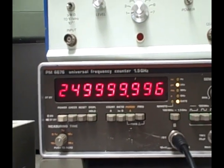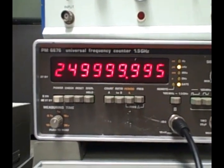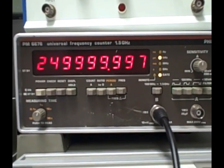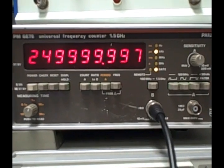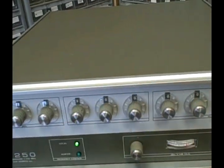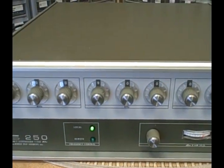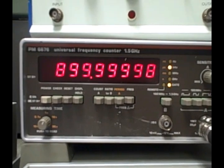Dialing up to 250 MHz, the high end, we had to set 249 and all nines to get there: 249,999,997 Hz — so within three hertz of 250 MHz. I then dialed to 900,000 Hz, technically below the specs, so I can't really expect an output — but I'm reading 899,999.98 Hz and I do have a nice waveform. So I beat the spec.